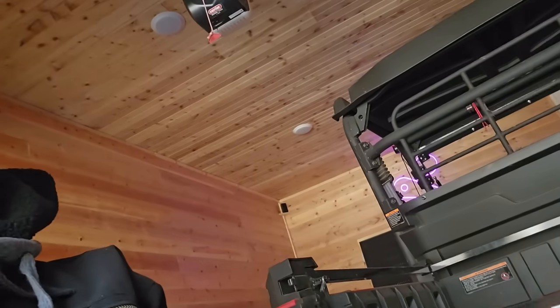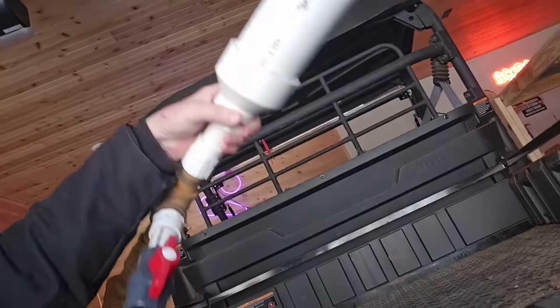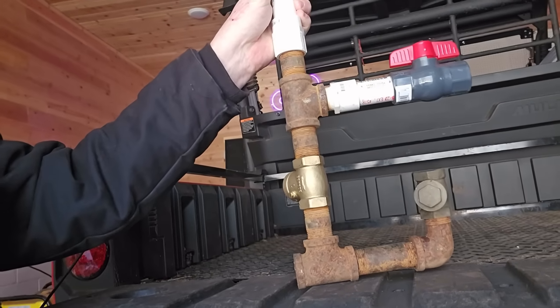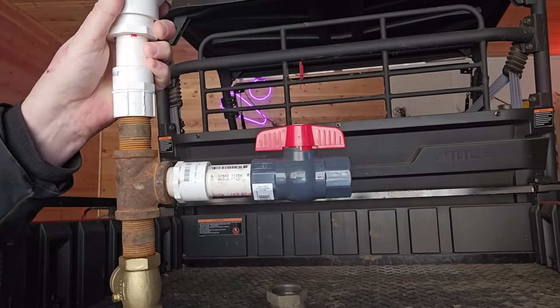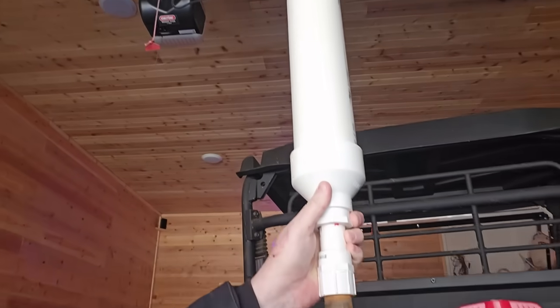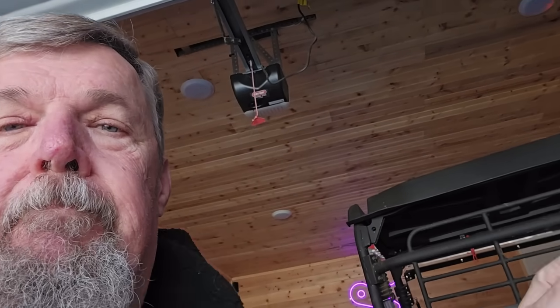Specifically, mechanically, using water pressure to help move the water. I built one of these — let's stand it up so you can see what it looks like. Down here on the bottom is the input, and up there, the red handle, is the output. There are a couple of valves, and then I've got a pressure chamber up top that for my elevation and distance is 31 inches. Inside there is also a bicycle inner tube, kind of inflated, to help with the pressure and have an air pocket so this doesn't just fill with water and shut off.